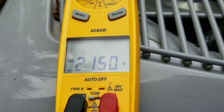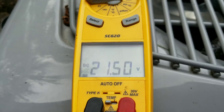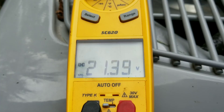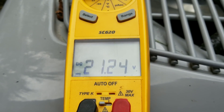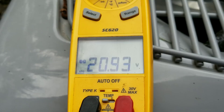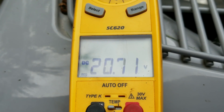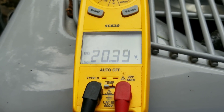Just goes to show you that those warning labels are there for a reason. Make sure that if you're going to be working on these units, you do use a multimeter and double-check those terminals to make sure you've bled all the voltage out of these boards before you reach in and grab them, because it will definitely make for a bad day if you don't give enough time to bleed that voltage down. Keep that in mind whenever you're working on these inverter drive systems — hope that helps. Thanks for watching.